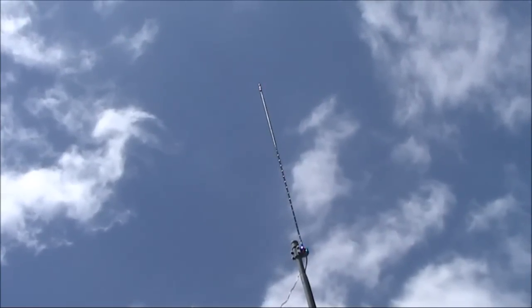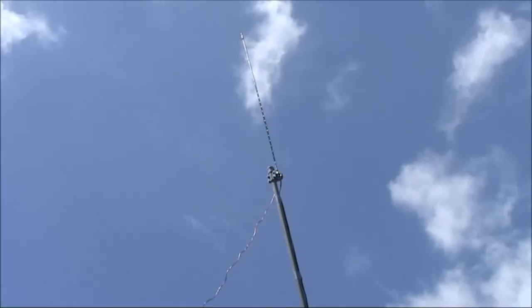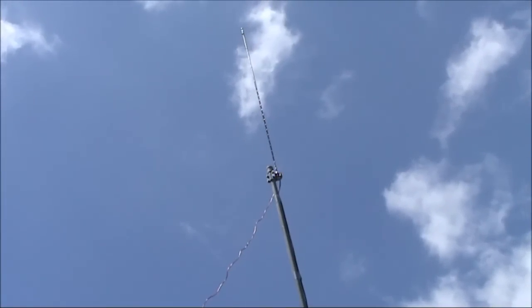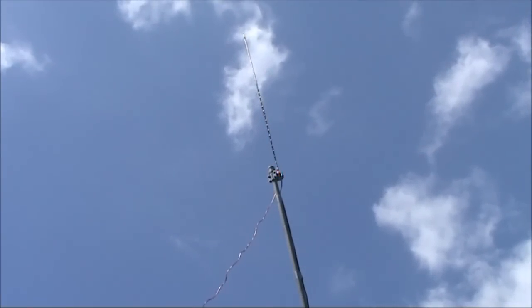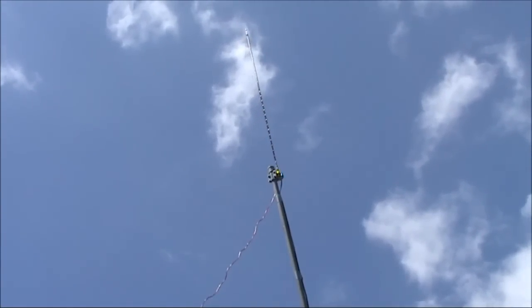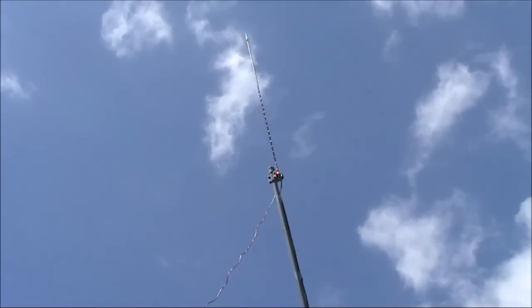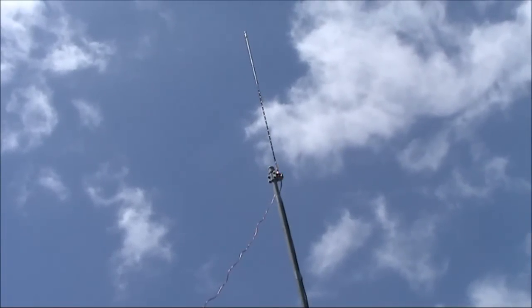This is about the simplest possible antenna you can get for 10 meters. The antenna is actually a mobile whip for 27 megahertz. It's one and a half meters long, but I've cut off about five centimeters of the wire at the top to make it resonant on about 28.4 megahertz. That's convenient for the SSB part of 10 meters. If you want it for 29 FM, make it even shorter.